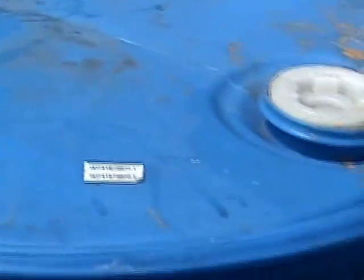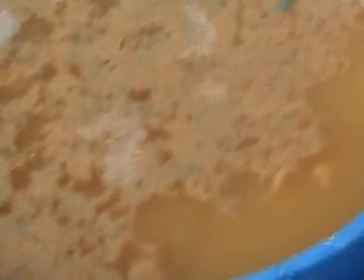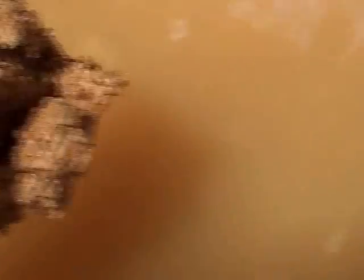I decided we'd do that to see if we could see any difference. The material we're going to run is from an ethanol operation — stillage, fairly coarse. I see a little bit of blue plastic in there; we got most of that out. It's fairly coarse — not flour, not dust — so it ought to press well. It does have a tendency to channel, or squirt like mashed potatoes.